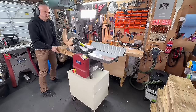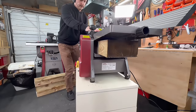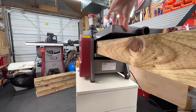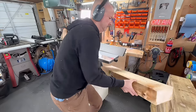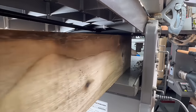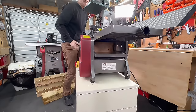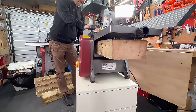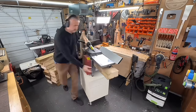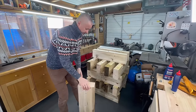In case you're wondering, garden sleepers is probably the worst type of wood you can use to make furniture and I learned it the hard way. I wasn't able to measure the moisture content in the wood - I knew it was wet on the outside but it seemed right after I planed it. I let it dry for a few days but when I glued everything together the glue wouldn't set even after three days. It was super cold and raining the whole time, so I wasn't sure if that had something to do with it or whether it was the glue, but it was so frustrating I almost gave up.